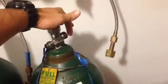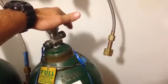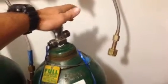You'll want to make sure that you alert people that you're getting ready to crack a cylinder. You've got to crack the cylinder because there could be some debris and stuff inside of that opening. Also, what you want to make sure is you try not to — when you're doing this — you want to have gloves on.